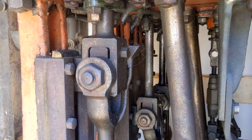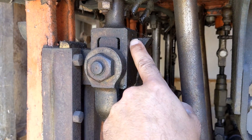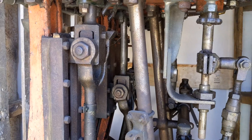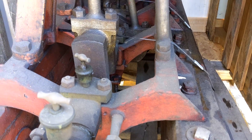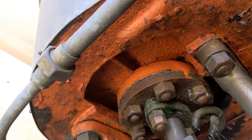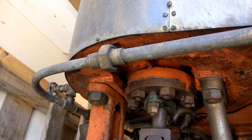The wrist pin bearing looks like maybe a wedge block with an adjustment screw to tighten the brasses for the wrist pin. It'll be interesting to see how that works when you pull it apart. I am wholly impressed so far. They've even scalloped out the casting for the cylinder underneath here to reduce weight. You could put insulation up there to make it a little more thermally efficient as well.